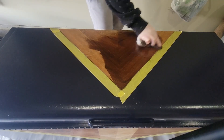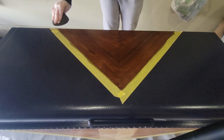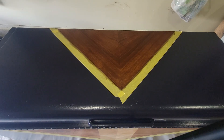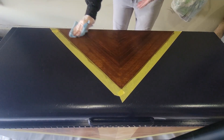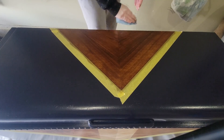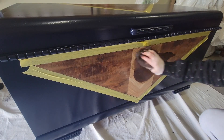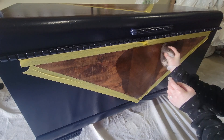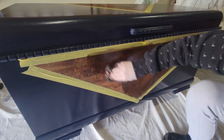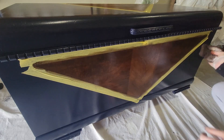Now I'm using a dark walnut stain by Varathane. I put some delicate tape down so I wouldn't get stain on my painted surface — this is before I decided I wanted a bigger triangle. I just wipe away any excess stain with a rag going with the wood grain to minimize streaking. This is my second or third time using a staining sponge and I'm starting to like it more — it doesn't absorb as much stain once it has more on it, so I'm not wasting stain. It doesn't leave lint behind and it's reusable so I keep it in my freezer.